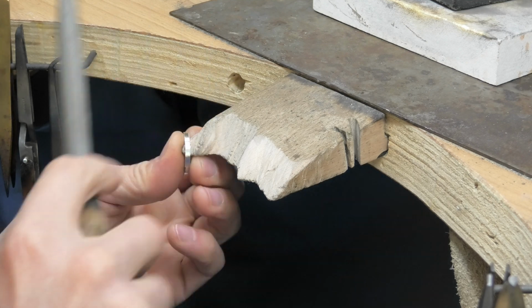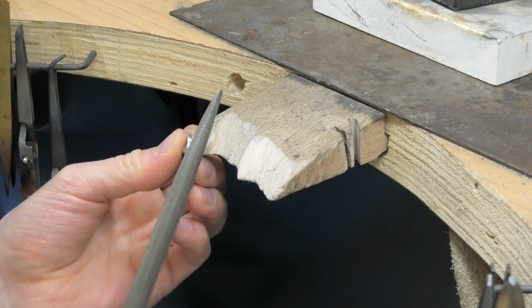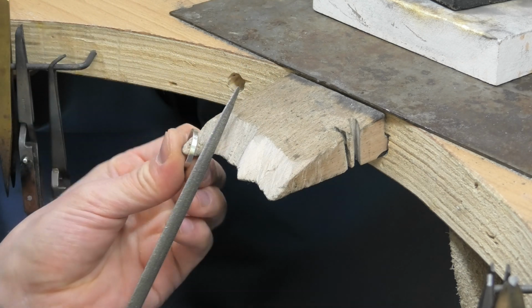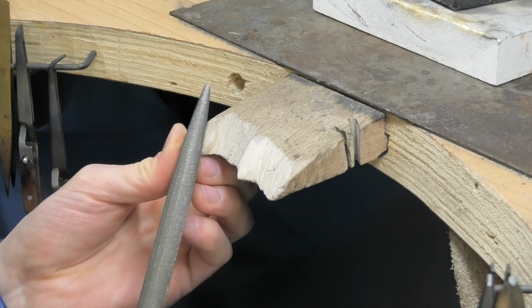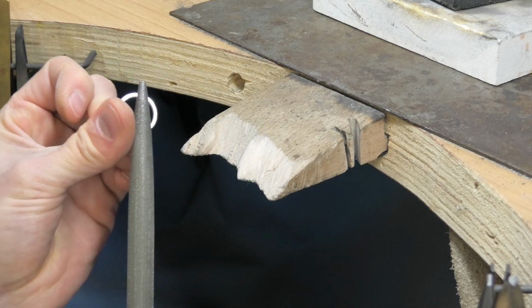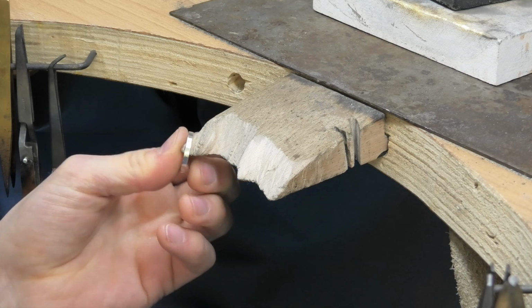But even if you did that first and then made a ring, the customer might be very specific about wanting a really steep curve on the ring, which the rolling mills don't usually do. So you might have to increase that curve with your file afterwards, or just do it like I'm about to do, turn a flat section ring into a D-section one. So this now is flat, that's what I mean. It's flat on the sides, it's flat there, it's flat there. That's what I'm talking about when I say flat section.